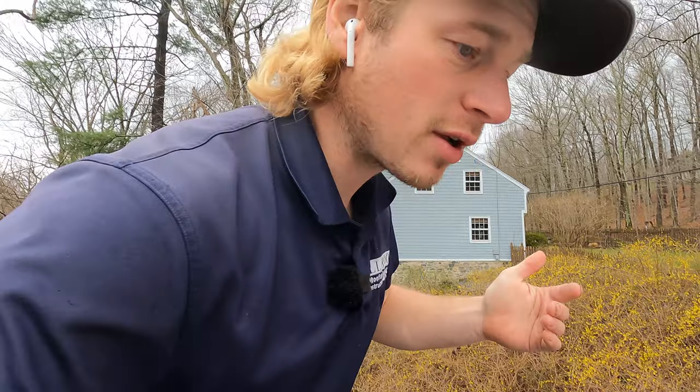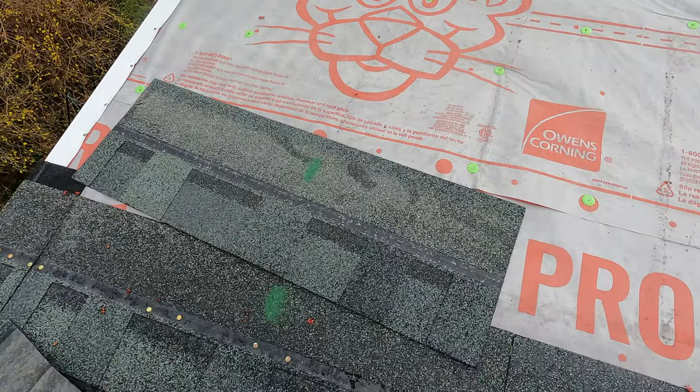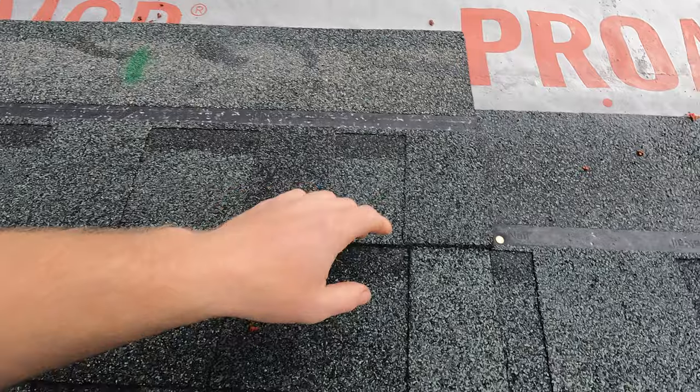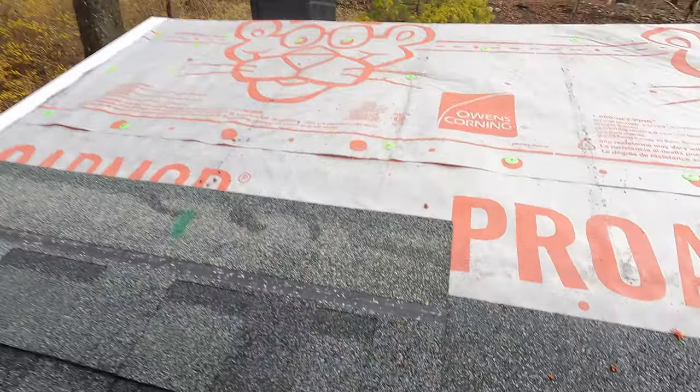Here's how I make sure the joints don't line up. If you just put another full shingle directly over the previous one without offsetting, the gap falls right on the nail and you're only relying on the base sheet to keep you waterproof — that's terrible. The sun can actually get through and damage the base sheet too, and then you're out of luck.